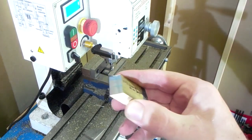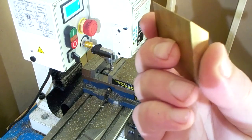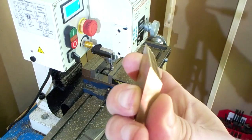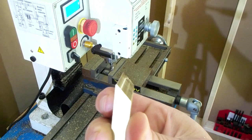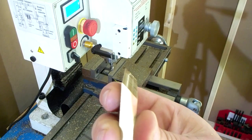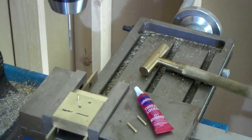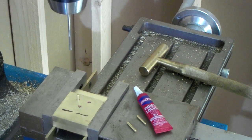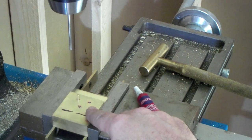Put a 45-degree angle on the front sole - you want to stop just short of making an actual point, just before you hit a point. I put the rear sole and the bed boss together, squared them up, and drilled three holes for pins to hold them together.